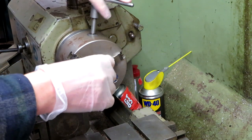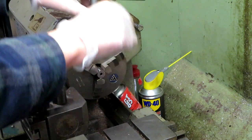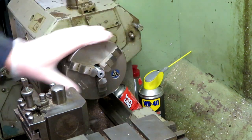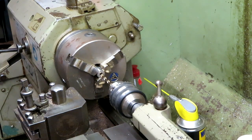So the first thing to do is actually to drill out the center of this and then we can put a sleeve inside. At the moment the precision doesn't actually matter — we're just removing metal, so I'm not using any special techniques here. It's just my three-jaw chuck in my very worn out Boxford lathe. I've got to admit the work I'm doing today comes very much under the category of experimental work — I don't even know if I'll get this to work, but I still think it's quite interesting just to have a go.